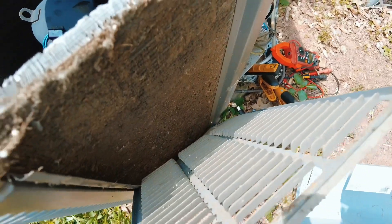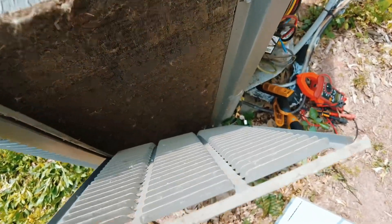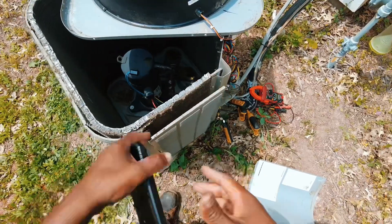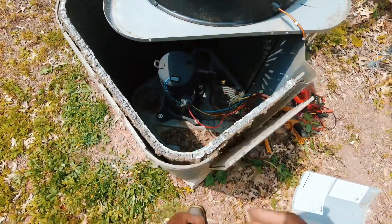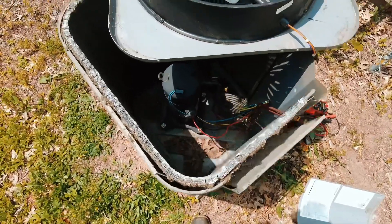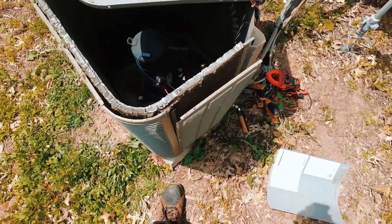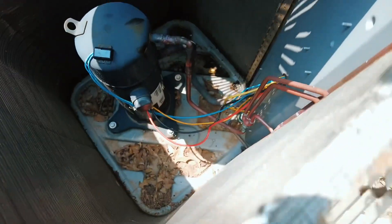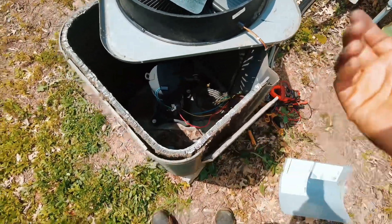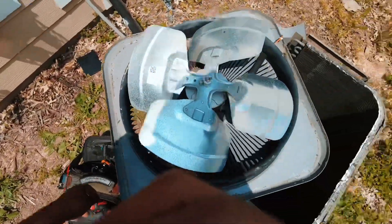Look how packed that coil is, man. Terrifying — it's like that all the way through. This system might not even have the wings to fly again, being low on refrigerant. I'm going to go ahead and check that evaporator coil. I was off on this — there doesn't seem to be a leak here, so that's not oil, that's just some water. We're going to go up there and check the evaporator coil, which is Lennox, so we already know what the fate of that's going to be.